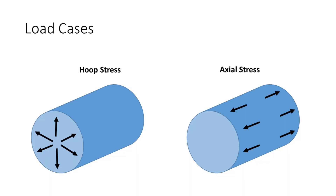We only need to consider two stresses on the case. The first is the hoop stress from the pressure inside the case, and the second is the axial stress from the stress on the end caps. While theoretically the case only needs to survive the maximum pressure of the motor, to make it more useful I'm going to design this case to work all the way up to 1,500 psi, so that I can put possible future motor designs in it as well.